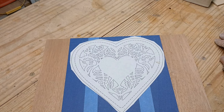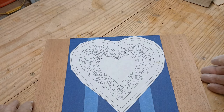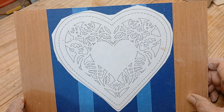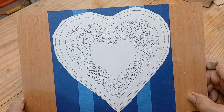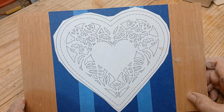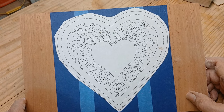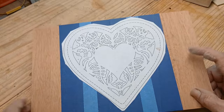So I got my material in for the rest of the lid. And this is where all the work really is. Got all this fretwork to cut. That's mahogany. It's fairly easy to cut. I'm gonna do it with the number three blade. I've already got all the holes drilled. And then when I get it cut out, I'm gonna put the finish on it.